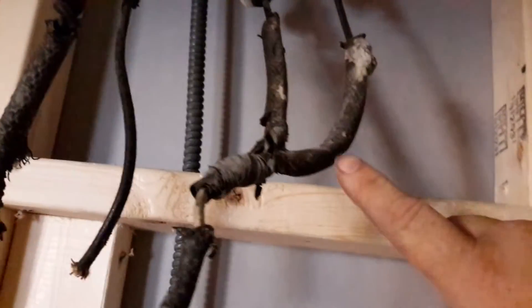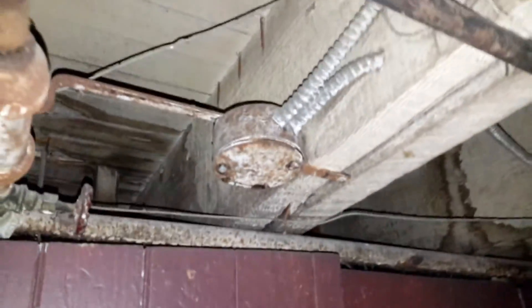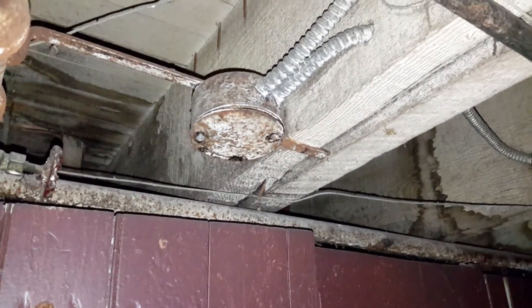We have a circuit right here that comes down — I know this is power going down and power going up. So if we split these up, we might be able to split a circuit. In the basement, what we want to do is follow the existing wiring around and see where it goes to the first floor, and whether it leads up to the second floor. You want to follow all your knob-and-tube wiring around and see where it goes. When we disconnect the knob-and-tube down here, it's either going to wipe out a first floor plug or light — which is good — or it might affect something on the second floor. You can see more knob-and-tube here, and basically you just want to trace these lines.